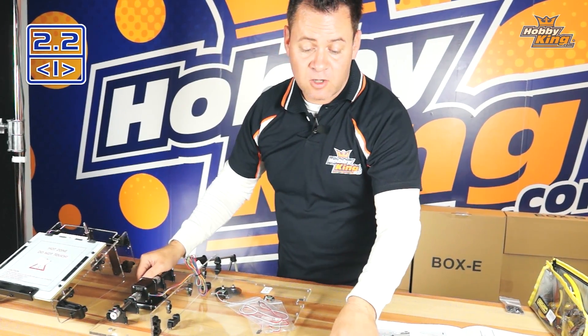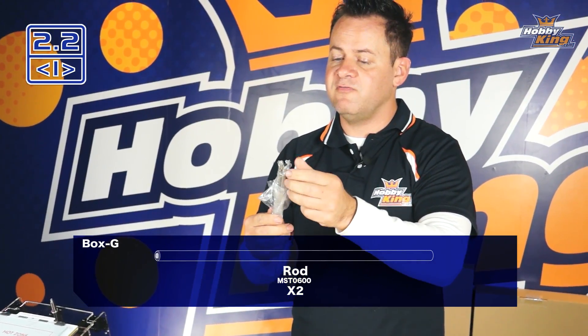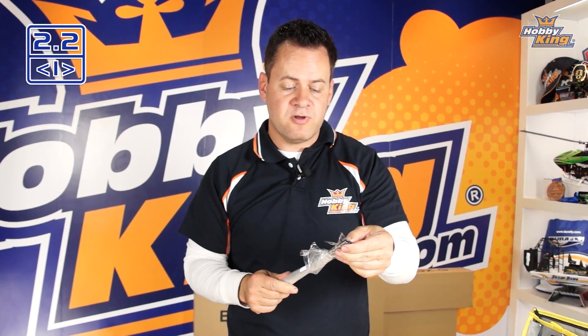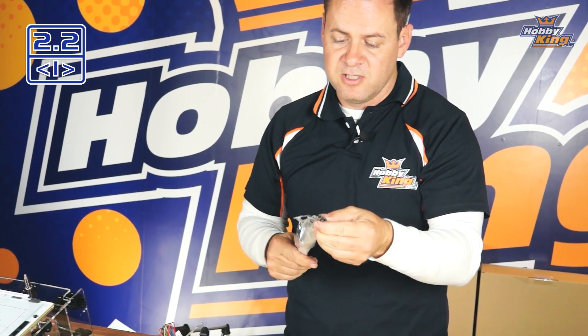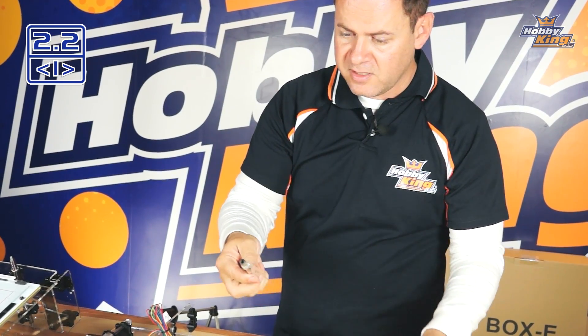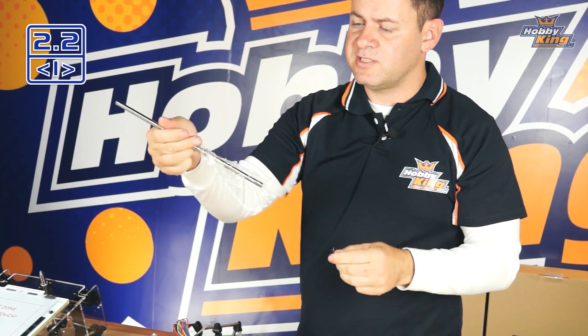The first thing to do is open up these rods. You'll notice they have a piece of plastic wrapped around each one — that's because there's a little bit of oil on them to prevent corrosion. They are ground hardened steel precision rods. Definitely leave that plastic on until you're ready for assembly. When you are ready, make sure you remove it because it's so thin you might not see it, and it could get between the bearing and the rod and cause damage.